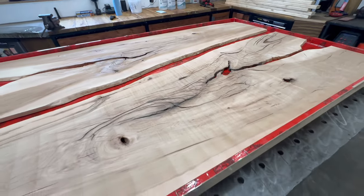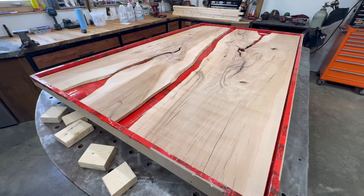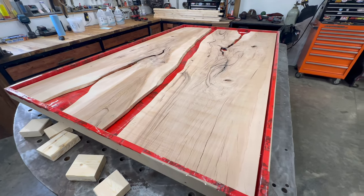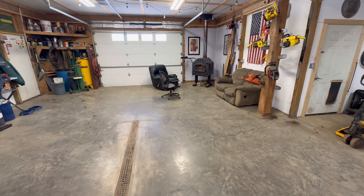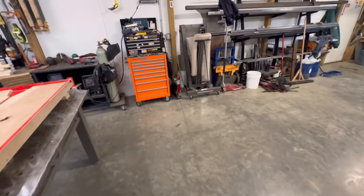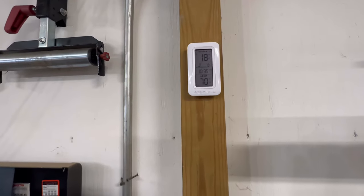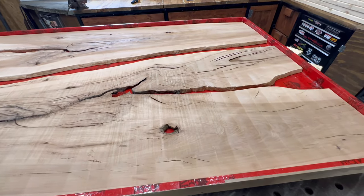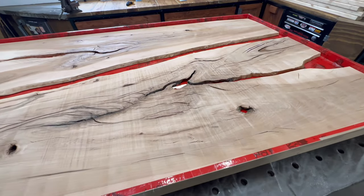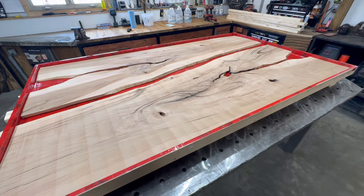I'm a little worried. Last night it got really cold. It was like 8 degrees. And epoxy is pretty temperature sensitive. So I've had the wood stove ripping for a while. And it's 70 degrees in here now. 18 outside. So for this epoxy, they say it's ideal between 70 and 74 degrees. So I'm just gonna have to keep watching the temperature in here.